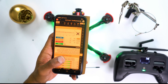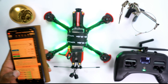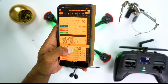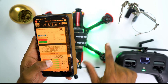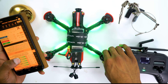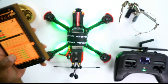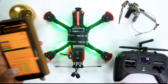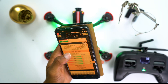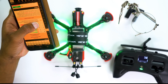So here's the motors tab — this is probably going to be the most interesting part of the whole video. Props are off, which you always want before doing this kind of thing. I'm going to spin up a couple of motors to see which direction they're running and then change the motor direction as needed. Let's see if the motors can actually be run from the app.